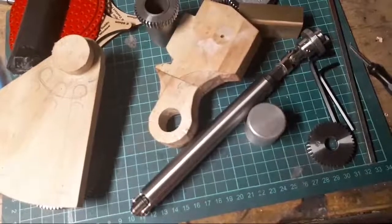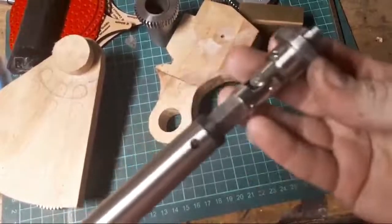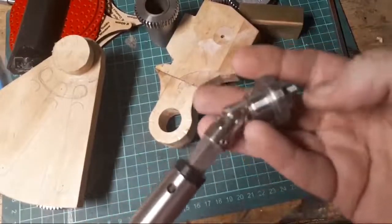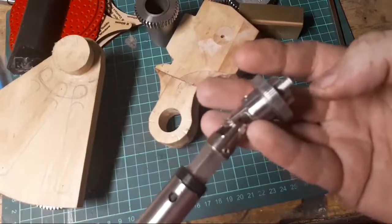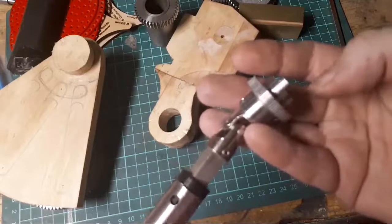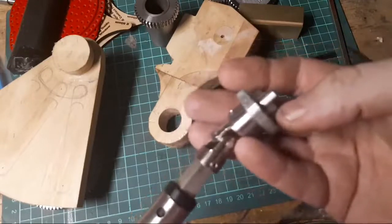So it gives us a free wheel position and a lock in the dog clutch engaged position, and there's a lever here as the compound moves forward or along, that's adjustable, and that'll knock this off the dog clutch, so that'll give us an automatic stop.